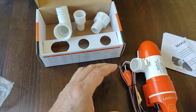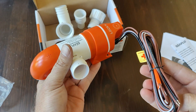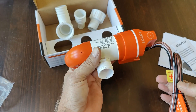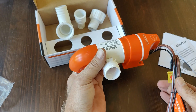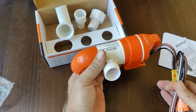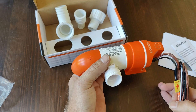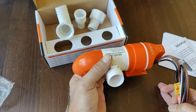These are the different sizes that it comes with for outlets, and even an elbow. Another interesting feature is that when you have it hooked up for automatic operation, when the bilge pump does come on, the manual wire will send a 12-volt signal so that you can power a light on your dashboard showing you that the pump is on, or even that it comes on for those two seconds when it tries to look for water. That way you can verify that the pump is working just by seeing the light flash on every two and a half minutes on your dashboard.